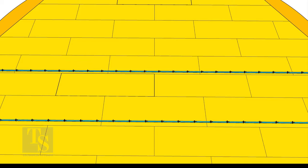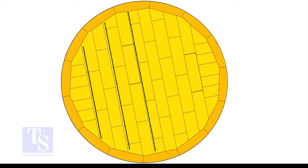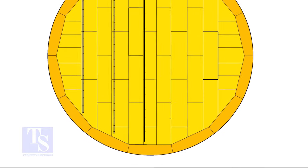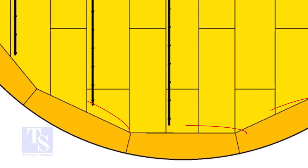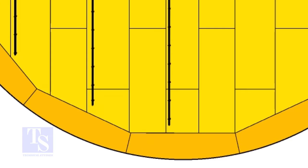After finishing the alternate joint welding, apply the same method for the remaining long seam welding. The bottom plate to annular plate welding shall be done only after erecting a minimum of half the number of shell courses. The bottom plate welding will be done with the same method.